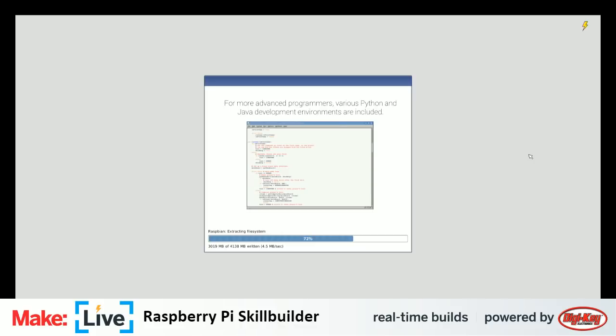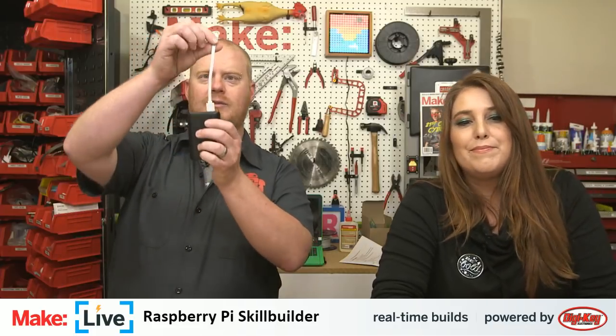Several people on YouTube are also confirming that long cables will give a larger voltage drop. Yeah, that makes sense. Fortunately, with this battery pack that we have here, we only have this very tiny cable, so I think we shouldn't be too worried about that. I occasionally have some really long USB cables that I use expressly for powering things that are less demanding of power than a Raspberry Pi, like various Arduino things, and sometimes those are like 15-foot cables. The USB cable at that point might be good for power, but I wouldn't expect the data pins to be very reliable there.